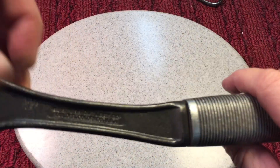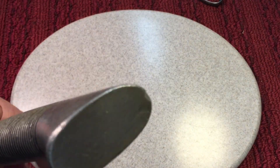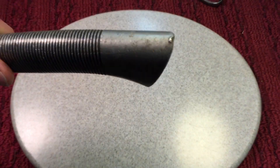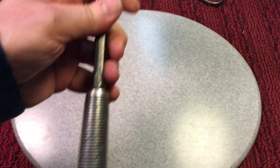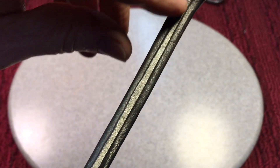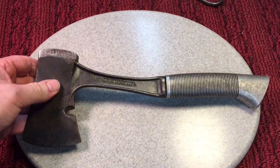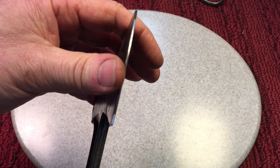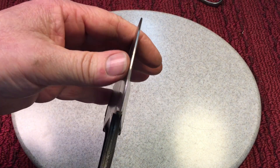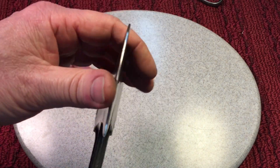Our post-wire brush evaluation — not too many surprises here. I took all the paint out and wire brushed everything really good. There's a little ding in the back we have to address — looks like it was dropped. There's some real bad corrosion on the back, the worst kind. And we got these big forging lines along the back of the edge — pretty deep. We dulled the tip to repair it and get that crack out, which we did. The last step will be sharpening the axe.